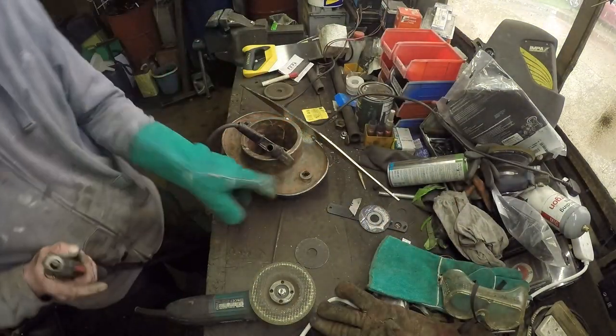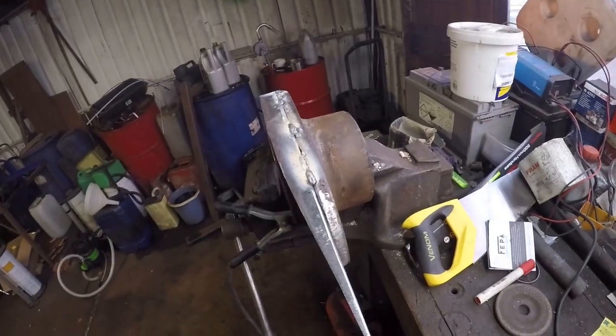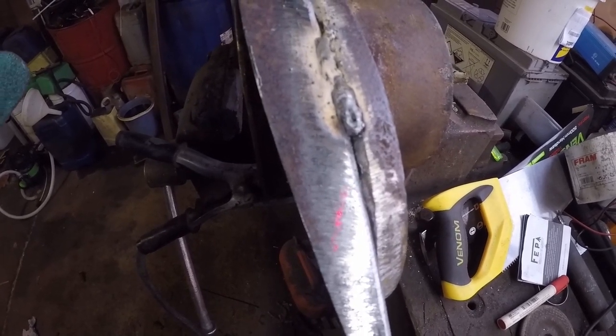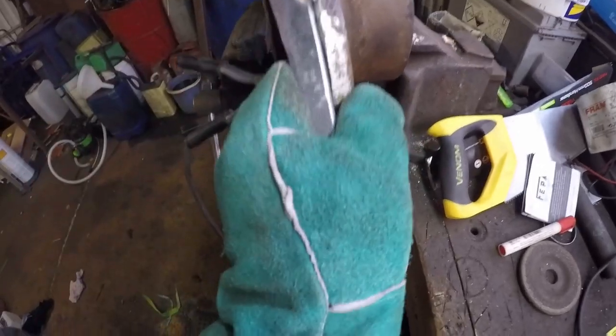Make sure you get plenty of heat into the cast. Might hear it tinking in a minute. Quick update - I've got that tacked on there, it's all very messy at the moment. You can hear it? Where the cast iron is not liking being welded you can hear it tink tink tink as it cools down. Sometimes these will pop. So yeah, tack here and then pushing down, working my way round, give it a little knock every now and again but trying to be gentle with it - obviously because it's not a structural thing.